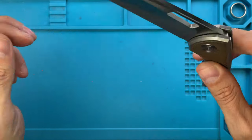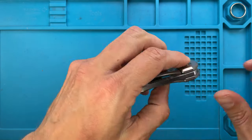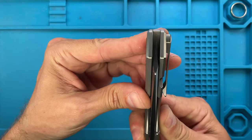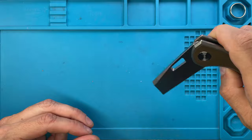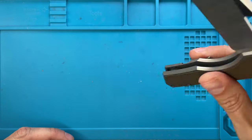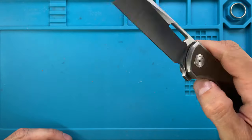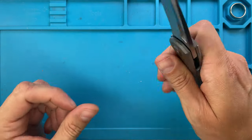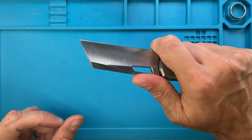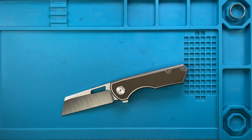Check for blade play — there's a little blade play, so this pivot screw has to go back a bit. It looks pretty centered to me. This thing snaps out like crazy — really cool action, guys. I'm not sure if I improved anything but I think it's a little bit smoother. Aesthetically this knife is not my jam, but the action is now perfected. Hope you guys enjoyed this video, thanks for watching and stay tuned!